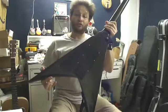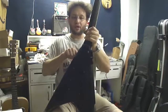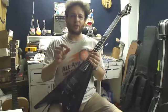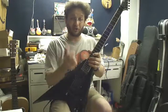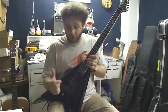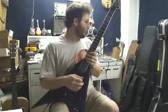So that way there's no confusion. There's a board that goes inside that has 3 trim pots, one for the pickup input, which is the driver itself, and then another trim pot for the gain of that, and then a smaller trim pot for the harmonic. So you can adjust it all kinds of ways, but you have to be careful when adjusting them, because you can get this squelch going with the harmonic, and it was very important that I controlled that, and I think I got it really well controlled.